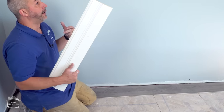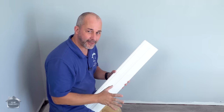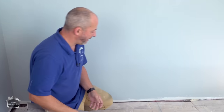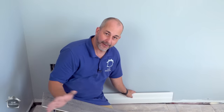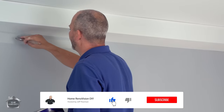And then I've got probably 2 days of touch-ups and waiting for the good sunlight and all that sort of thing. I'm not in a hurry to finish the paint. So while I'm working on the paint, I can also do all the trim. Here we go. And of course, if you install your drywall with a gap under the floor, you have lots of room for expansion and contraction with any kind of flooring that you install. So once everything is all done, we're gonna take in our second cut.